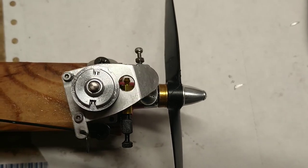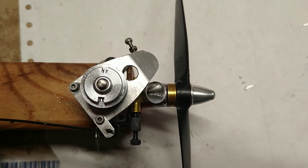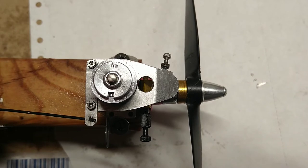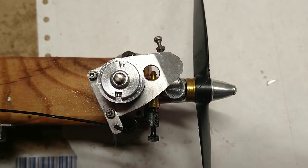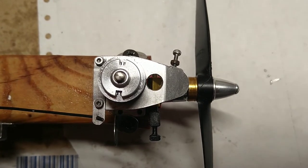The cooling ribs act as flanges or thrust bearings to control where on the axle the throttle piece sits. This is important since we ultimately want to tightly cover the intake without any major gaps. At the same time, the throttle must rotate without much resistance so that you can use a small 9G or even a 5G servo to operate it.